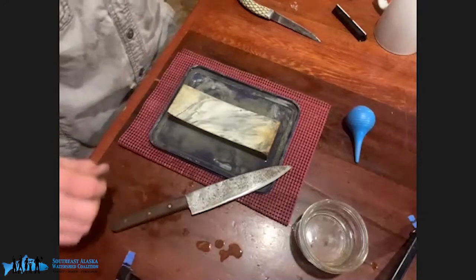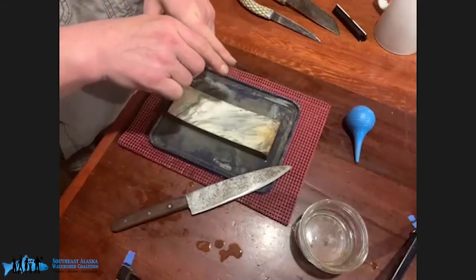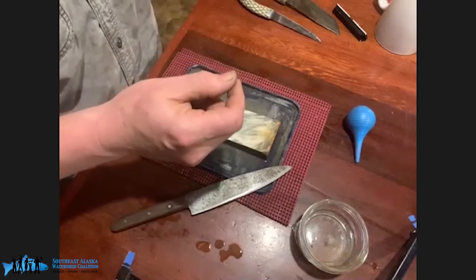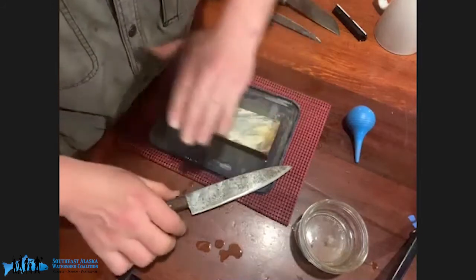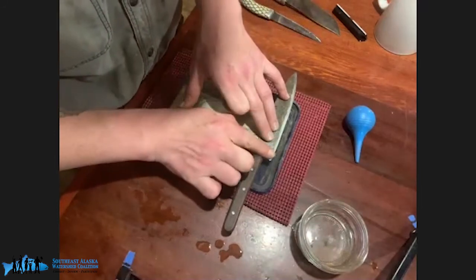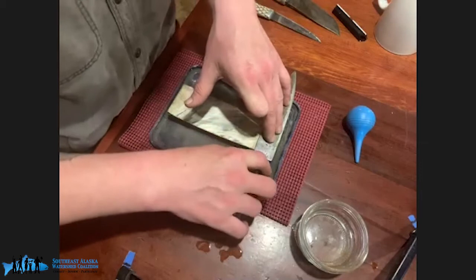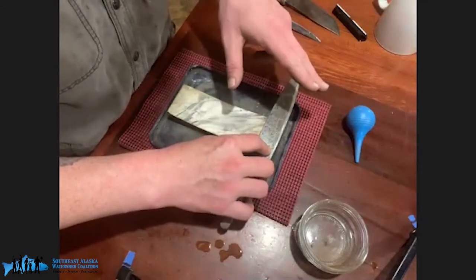Serrated knives, yeah, no, they are not. For a serrated knife, you'll need a steak knife, or some pocket knives have serrations. You'll need a round file, which I've got a couple around here somewhere, but not handy. What I do is brace the knife like so, and then take that round file and carefully go down each serration in the direction from spine to blade, right? So going that way, like so. We're imagining my finger is our notional round file.